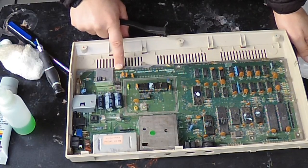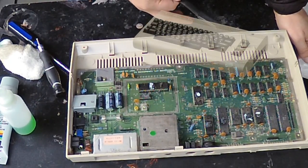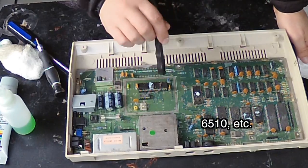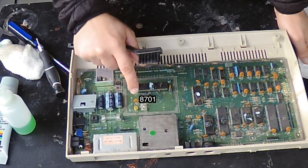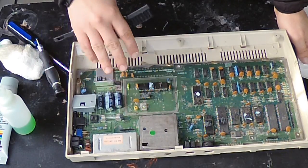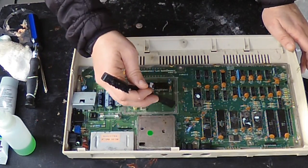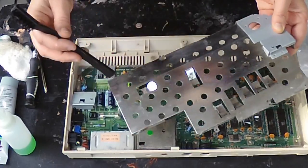Here's what's really interesting: 1984 assembly 425. So really this was a board that could have easily been put into a bread bin — it's practically a bread bin machine that just happens to be in a Commodore 64 C case. You'll notice the chips are all the 6000 series, so they're not the later generation 8000 series chips. Although what's interesting is there's an 8701, which assists the VIC chip — it basically consolidates all the mess of parts that used to be on the older revisions into one chip. Also interesting: this revision took away the shielding that used to be around this piece here, because they added a big piece of shielding that goes over the whole thing.